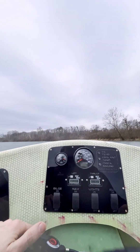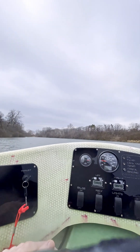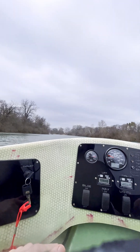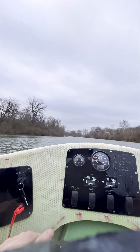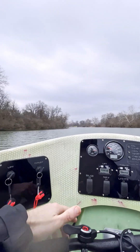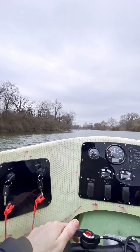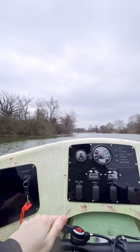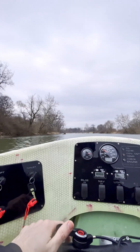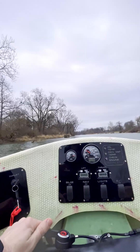What we call a plow-in is when a hovercraft stops riding on a cushion of air and the hull makes contact with the water. Many hovercraft, particularly older designs, have plow characteristics that can vary from unpleasant to dangerously violent, in some cases resulting in the occupants going for an unexpected swim. The combination of traveling at high speed with a strong tailwind and against the river current is generally one of the worst-case scenarios for a hard plow-in. Obviously, this is virtually non-existent in the Evolution — the hull shape is engineered to prevent the sudden deceleration necessary for a hard plow-in. I'll do it again later in the video so you can get a second look.